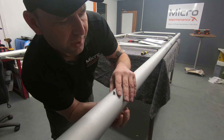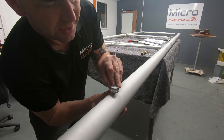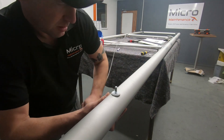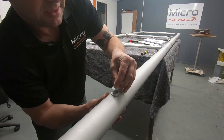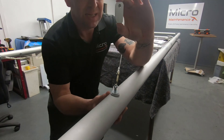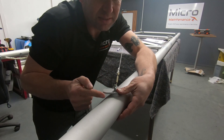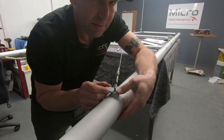When putting this back together, remember the correct orientation. You want the aluminium saddle washer first, then a plastic washer, then the cable, then another plastic washer. This is key: when this goes in here, there is a tensioner bar that you put in, and it's important that the flat space is there so it can slot in. If you do it the other way, it makes life near on impossible.